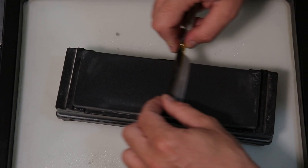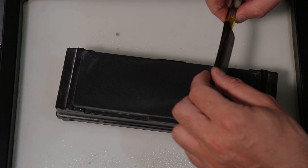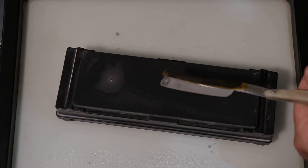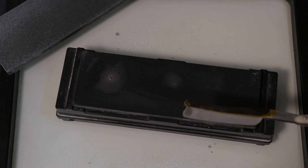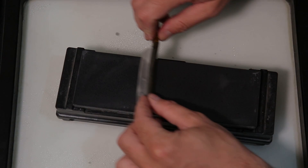Just working it to see what I can create. The hone feels pretty good because I created the bevel slowly on this stone previously, and was ready to go — that's when I decided to start again and film it. So the stone has been a little wet, which is always a good idea. Take the 1k which is up next and introduce a little water — just makes a bit of a softer feel.